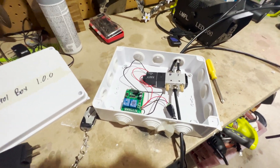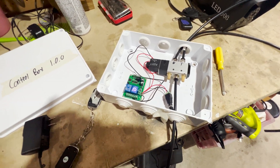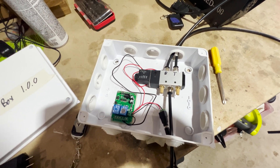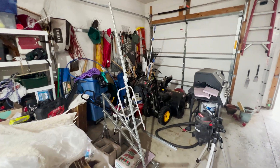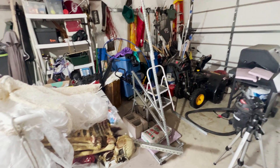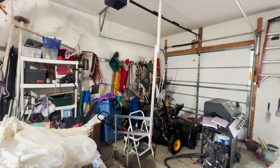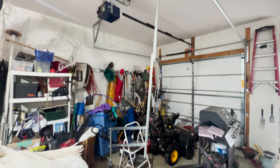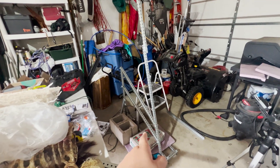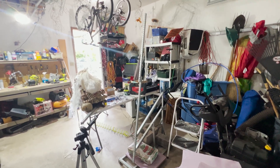I'll have a wiring diagram posted, and I'll post a YouTube video showing how I wired this with a diagram if you want to learn more. Without further ado, here is a demo of my pneumatic mechanism — right now I have it running on 100 PSI, which is a little overkill. As you can see, it has that slow release due to the airflow control valves. Here's another angle for a demonstration.